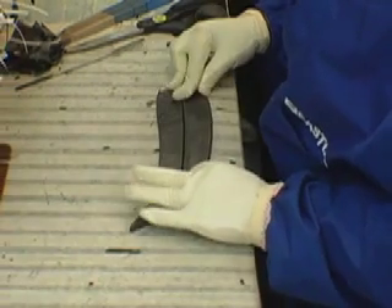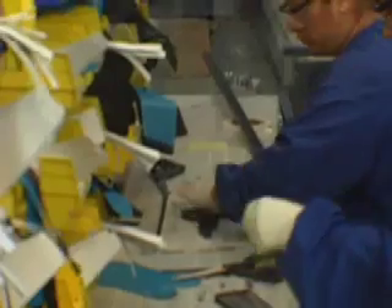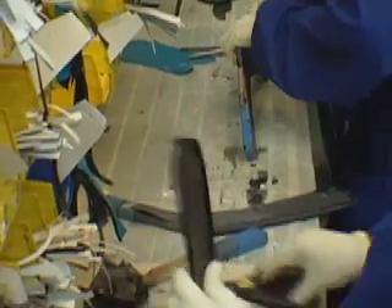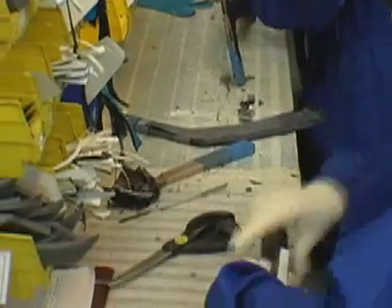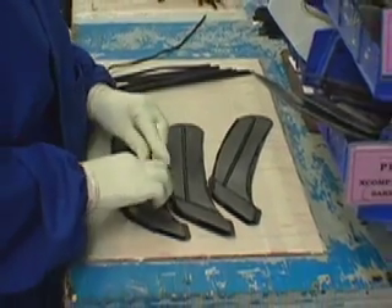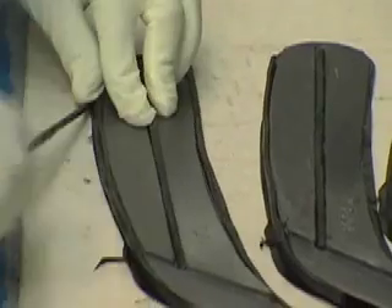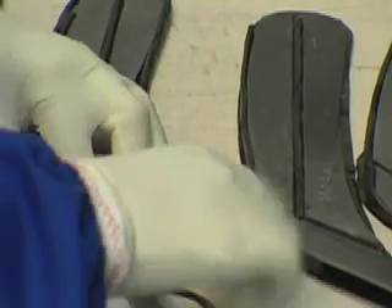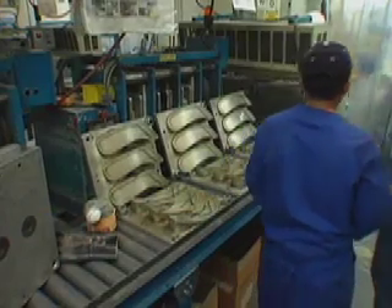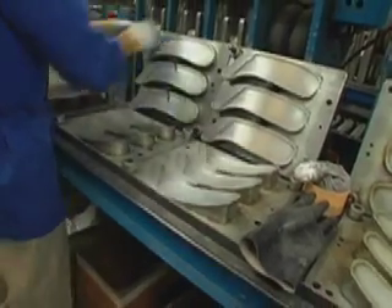The blade process is a little different. Cut materials are brought into a pre-form area where the graphite and the die-cut materials are actually wrapped around a foam element, creating the soft shape of the blade that will be put into a mold. What you're seeing here is actually the formation of a Z-carbon component. It does go into an open mold along with the shaft element and is taken through our patented Unimold technology to create the lowest kick point found in the stick.